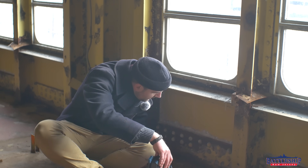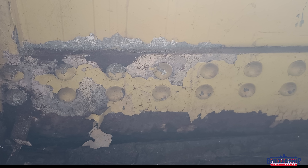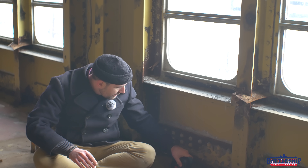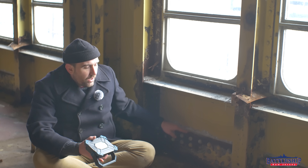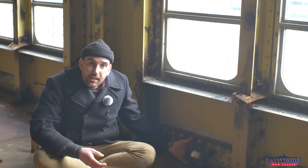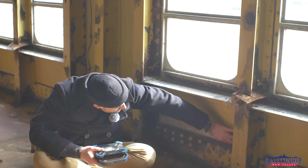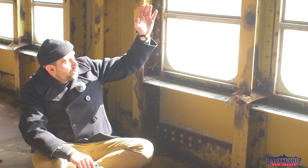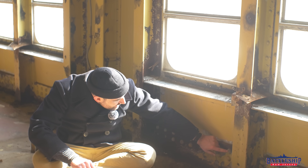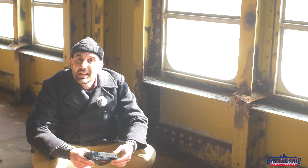So here you can see the deck is steel — everything below me is steel. We know that because we've got a magnet on the back and a light, and there it is stuck to the deck. This plate of rivets here is also magnetic. But this plate above it is non-magnetic, and you can see where the paint has peeled up, that is that silvery white color — oxidizing aluminum. So you've got aluminum superstructure and steel below. And if you look at the heads of these rivets, they are also that silver color and non-magnetic.